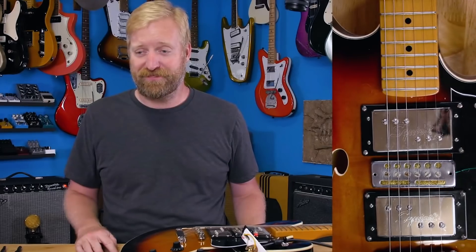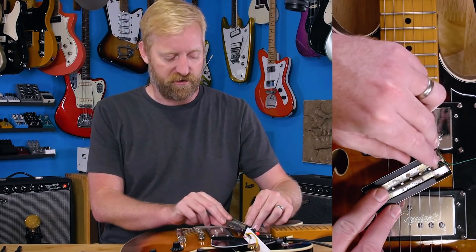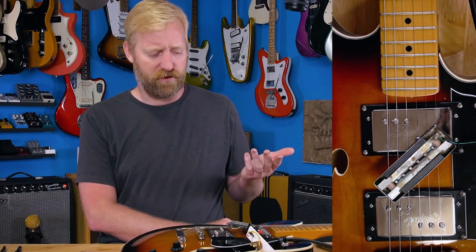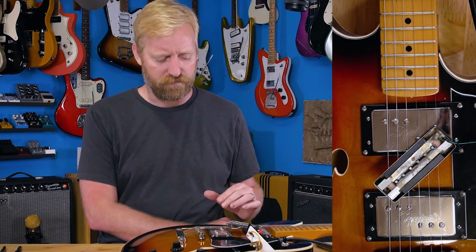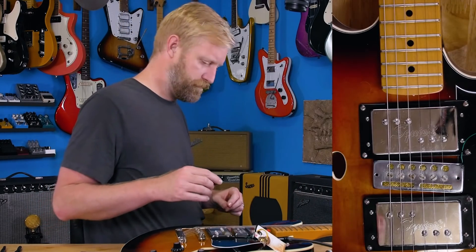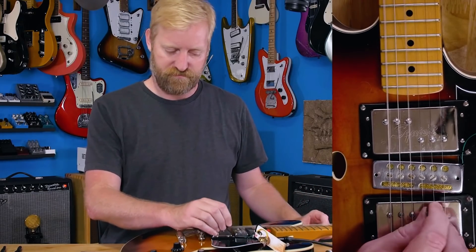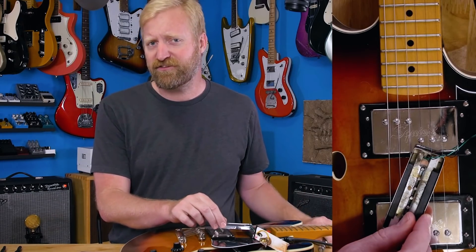Let's just check that Ryan's fix was the same as mine. I think I've already solved it. When I was removing it from the Strat, I was taking a good hard look at it and thinking about all the comments I got. I was thinking maybe one of these magnets fell out at some point during previous ownership and the person put it in the wrong way, and that's what's causing all these problems. My initial suspicion was that the poles are north to south across the length of this. So I flipped it over - nope, still sounds terrible.